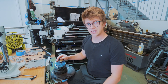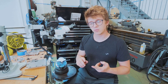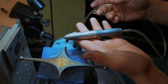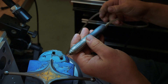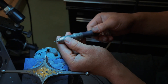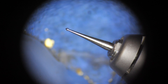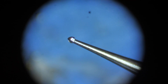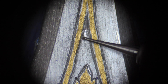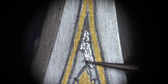We're going to continue making it pop by hogging away some of the background. There are a few ways we'll do it: number one, where we can, we'll use the gravers to cut away the material; number two, we'll use this bad boy right here — this is a 420,000-something RPM little air-powered burr. We can put a half-millimeter ball burr in the end and it'll cut away. See how teeny-weeny that is? A feather touch is all it takes — that works amazingly.